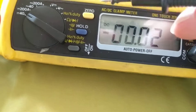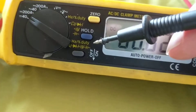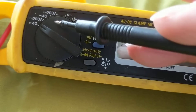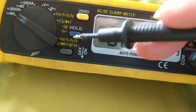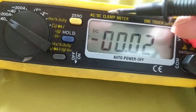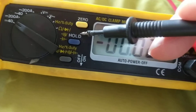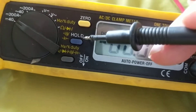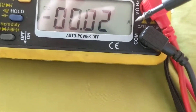All you're concerned with is measuring DC volts from the battery, or AC volts for whatever reason — sometimes you have chargers in your car. As I'll demonstrate, it has AC and DC functions over here. Some meters only make for AC, but this one does both AC and DC clamp measurement. So you can measure the output current of your car battery — if you have all your accessories and lights on and you're measuring 15 or 12 amps, you can put this around the wire and it will display how much current is flowing.